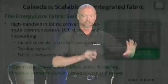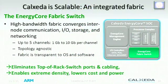The fabric is transparent. While it sounds really exotic, as far as your software is concerned, it's just an Ethernet driver. There are two Ethernet ports — two MAC addresses — from the software standpoint, behind which is this wonderful fabric. Software doesn't know anything about it; it's just standard Linux drivers. This gives customers dramatic reduction in cost by eliminating top-of-rack switches, dramatic reduction in energy consumption, and dramatic reduction in complexity building a large, high-density server.